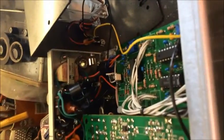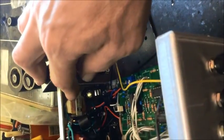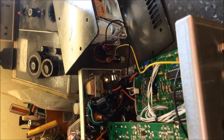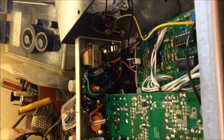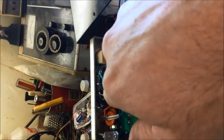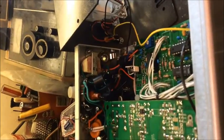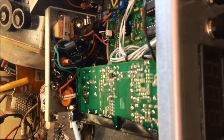And then one thing that I do on most of my audio processing equipment, most guys don't do this, is I put a 1-to-1 600 ohm to 600 ohm transformer in, which is right here, going to my audio line. And that eliminates any hums, squeals, things of that nature that could happen. Another thing that most guys don't even think about is a ground loop isolator. I built my own, and if you look here in the back, where the green wire is, you got a 1.2K resistor back there hooked with a couple diodes and a few other things, and that eliminates any ground loops that you may get, because you're dealing with different supplies, the board, the radio's ground. There's just so many grounds going on that you could create a ground loop, and that could create squeals and stuff too.